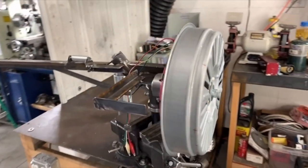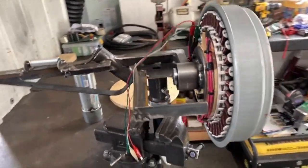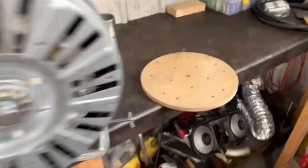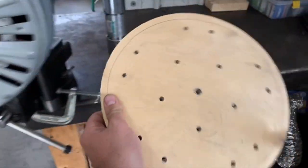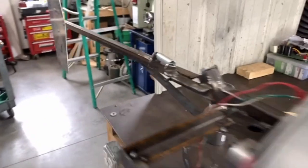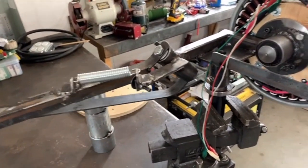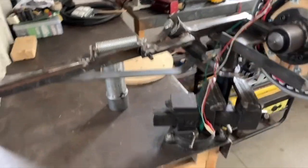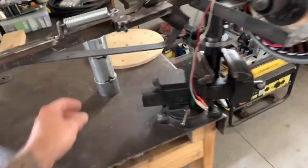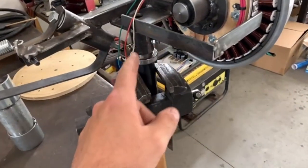It's starting to look a little more like a turbine. Still got to make the fiberglass surround for it, but the hub is made and will be mounted there with a direct bolt pattern for the blades. The furling tail is done — a 20-pound spring articulates sideways to draw the blades out of the way of high winds. The yaw bearing is done, and it just needs to be mounted on the pole.